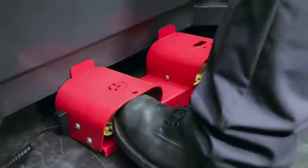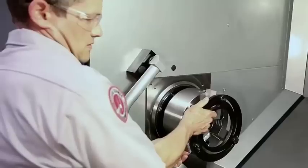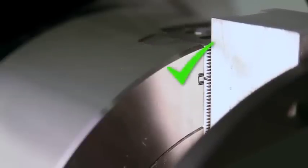Clamp in the desired center of stroke. Andrew unclamps the jaws and rotates the boring ring body slightly counterclockwise to bring the adjustable dowels inward slightly. The boring ring is now clamped at the center of the stroke.